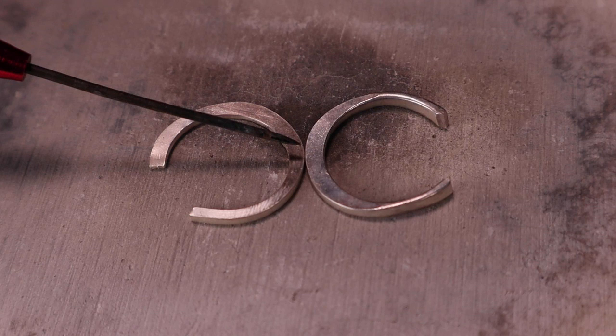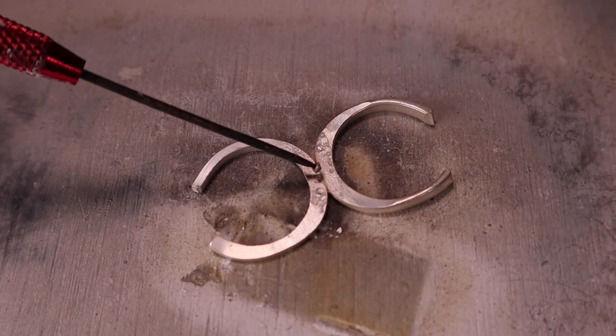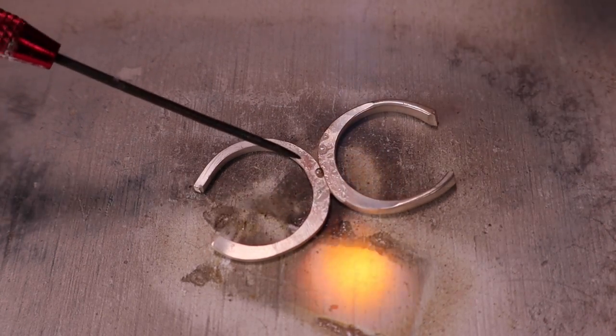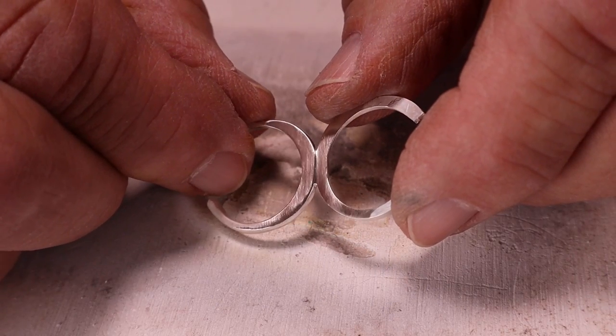Making a good fit isn't only for avoiding gaps, but assures our projects are stronger, smoother, and more professional. These 2 forged wires are only touching at a tiny spot, making a flimsy, weak joint. By filing a flat spot on both wires, this takes the solder joint from weak to strong, making a good fit with no worry of twisting or falling apart in the future.